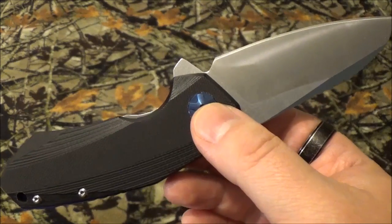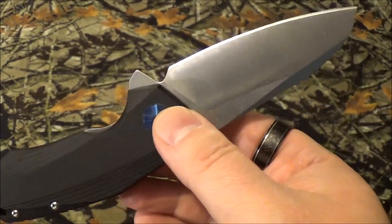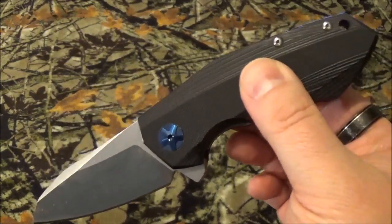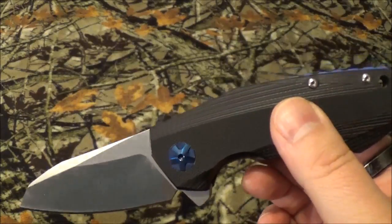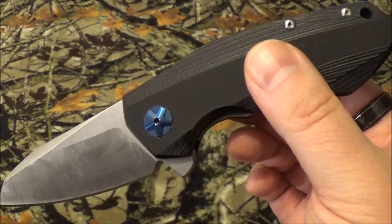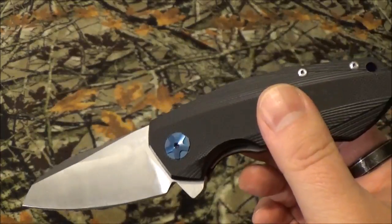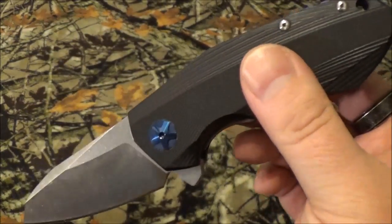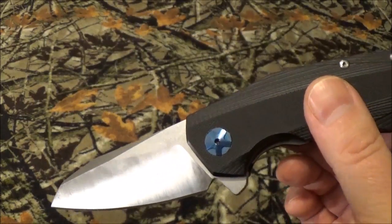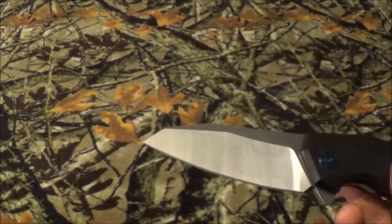That's kind of cool — here you are with a little machine right in there, and you can't fake that data. He sent me a lot of photos and I got some of the best ones for you. Now, we're going to post the results. I want to preface it like this: the PMI data is only as good as the information it has in its database. His PMI machine has D2 in it — it's there, he's got it — so if it's D2, it should register. I had him scan it once, and thankfully he did a second scan so no one can say we faked it.